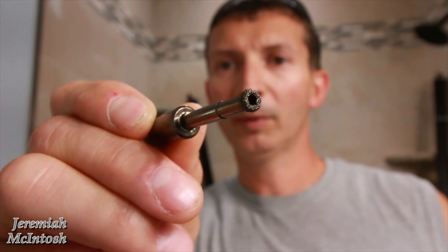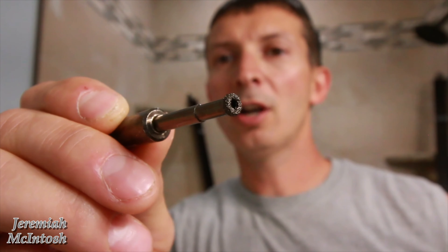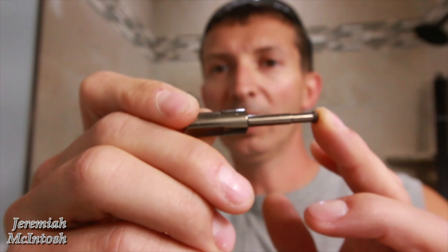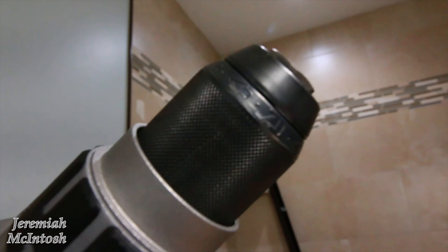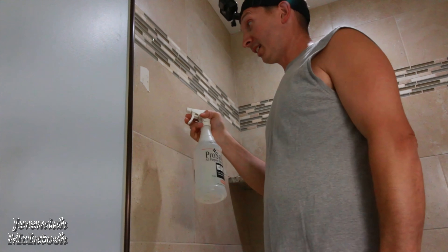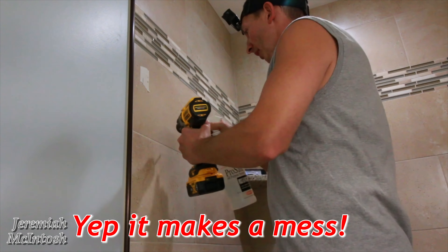For drilling the holes, the bit I'm using is a diamond bit made by Lennox. It has diamonds in the tip and is specifically meant for granite, porcelain, ceramic, slate, marble, and glass. You do not want to use a standard ceramic bit when drilling porcelain — you'll go through a lot of bits. This is a 3/16 bit. I'll put a link in the description. The instructions say to use water with these bits — I've never done this before so wish me luck. I'm going to try spraying it with water as I drill and get it started first without water.